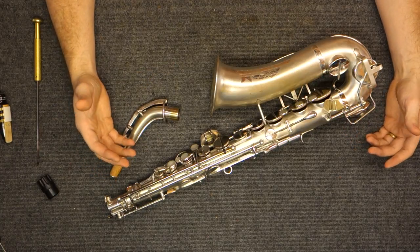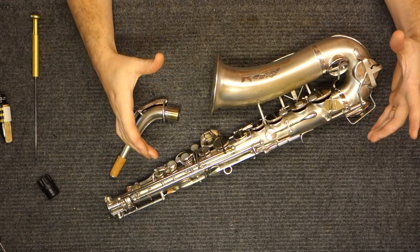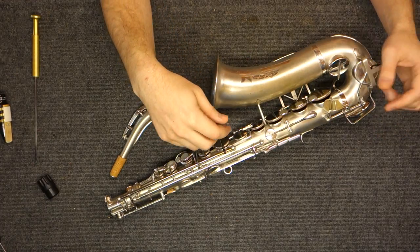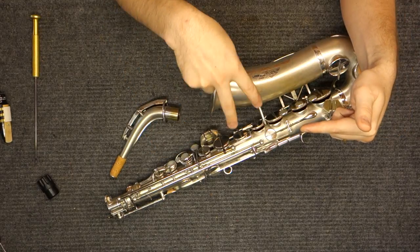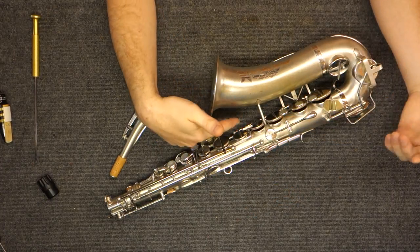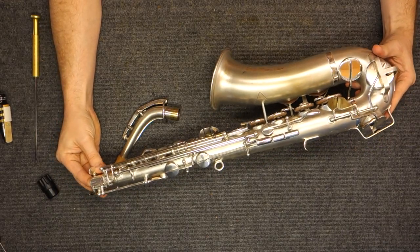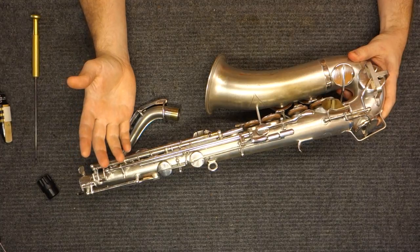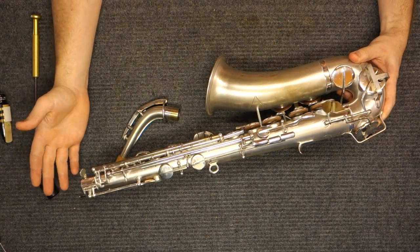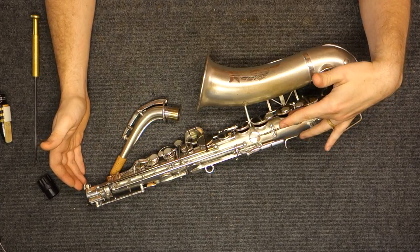The tooling for rolled tone holes is very complex and very specialized. When you talk about tooling with saxophones, you're not talking about screwdrivers and pliers — you're talking about tools made specifically in your factory with a single purpose, like a little jig that holds the hinge tube in place, holds the key spine in place, and sets the key cup so they can be brazed consistently. All that specialized tooling was left behind, and that stuff is really hard to make. So one of the things they were unable to get made quickly was the machine to make rolled tone holes. But you can make soldered tone holes with relatively simple machinery — a lathe, a mill, a bit of time, and some skill. So they switched over to soldered tone holes by necessity, and this is a very visible reminder of when this instrument was made.